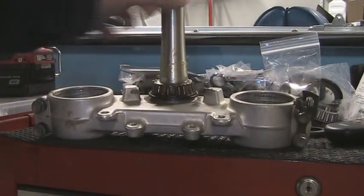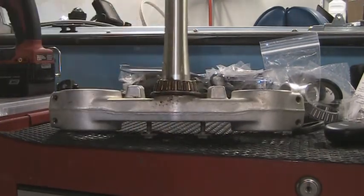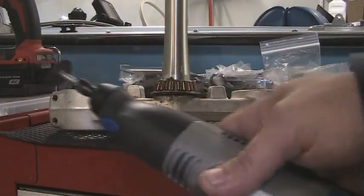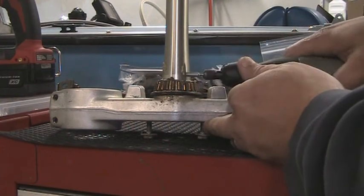I've already cut just through the bearing so far. I've cut this side, and you'll want to cut the other side. You can do it if you're pretty good with an angle grinder with a cutting wheel, but I'm just going to use a Dremel. The first thing you want to do is just cut the outer bearing off.